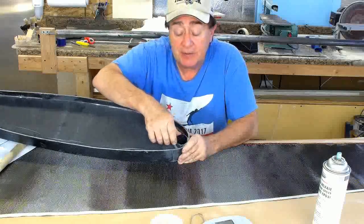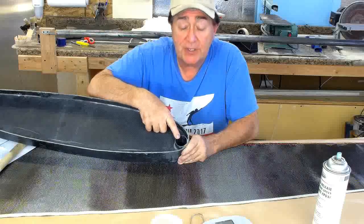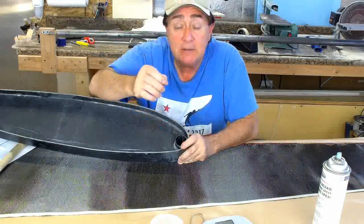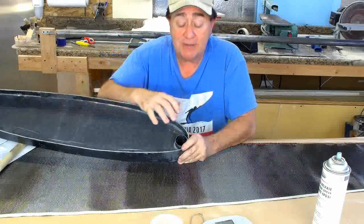This tube doesn't need to be very thick in carbon fiber. This sample here near the center of the wing is 40 thousandths of an inch thick, or four layers. But as you go further outboard, it doesn't even have to be that thick — it can be even thinner. And that's why we have the tapered piece of cloth.